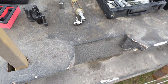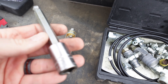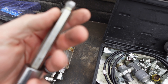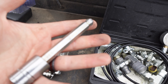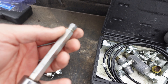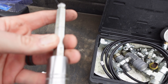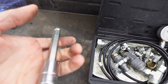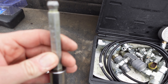Now this side is more equipment-specific stuff. This is kind of specialty — it's a 12mm long ball Allen. Excavators — Hitachi, Deere, Cat — pretty much most excavators use an Allen socket for the flanges. Getting around hoses on control valves and stuff, you'll need this long ball Allen. I've put some pretty hard torque on this and haven't broken it. This one is from Snap-on — part number SABLM12E.